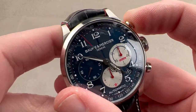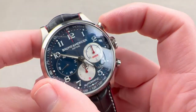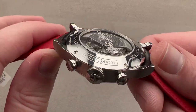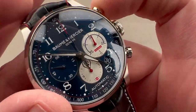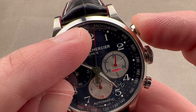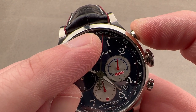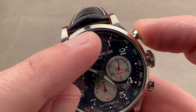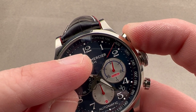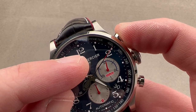We have one of the crispest cam chronographs I've ever encountered. Have a listen. It's very crisp — it feels good, it sounds good. And because it's a 7750 architecture, it uses an oscillating pinion rather than a conventional lateral clutch. When you engage an oscillating pinion, a lot of times it has very little jump to it. You press and hold, and it should have half as much to none of the jump you find on a conventional lateral clutch chrono, because with an oscillating pinion there's less play between the tiny pinion and the driven wheel. You can really see that smoothness right there.